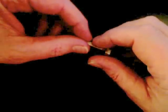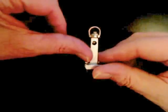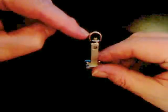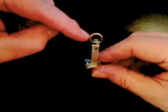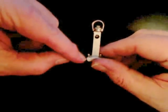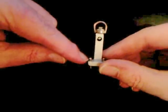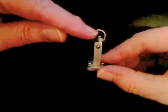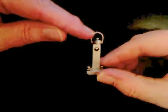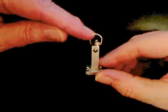This turns out is not a good thing. It puts a lot of pressure on everything, and it also changes the trajectory of the line when sheeted out and sheeted in. It also tends to pull down on the boom, which is not a good thing when sheeted in. So this is my new standoff, or fairlead. I've used the original swivel loop that I had — it will not swivel, as the previous one did not also. We've stood it off the deck, which will mount through the deck here, and gives us about four centimetres of vertical. That should line up pretty well just under the boom when the vang is screwed down.